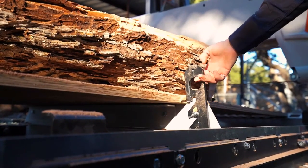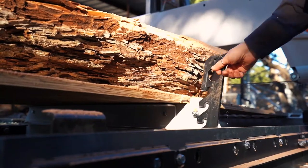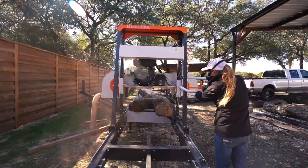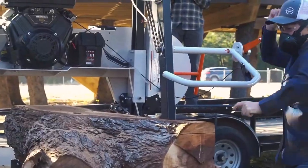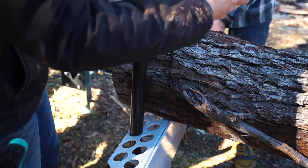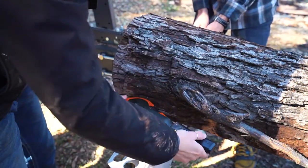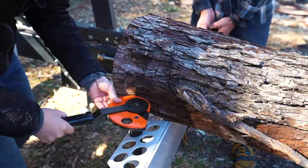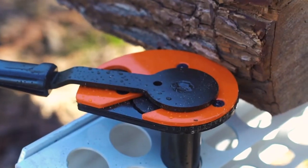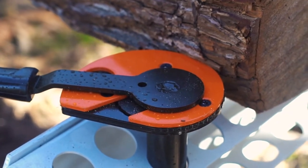One side of the bed has steel posts that can be adjusted up and down to catch the log. The blade rotates this way, which will pull the log into these posts. In addition to the posts, Logosol has these really ingenious cam locks that fit into the cross sections of the bed to clamp the log into place. If you need a clamp, you just use the cam to wedge it up against the log snugly, then use the locking feature to hold its position.